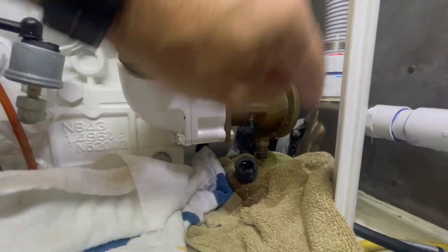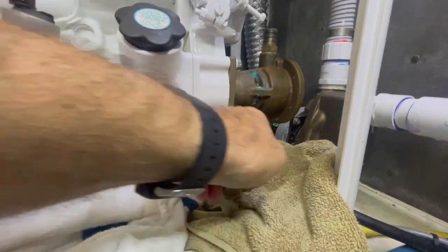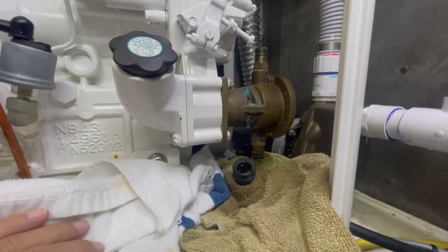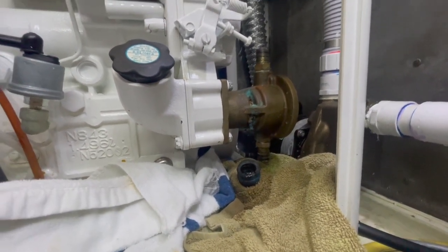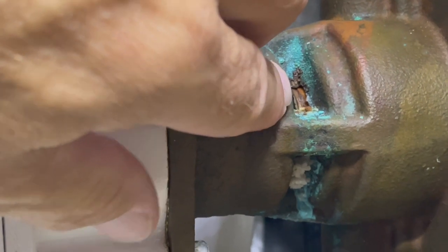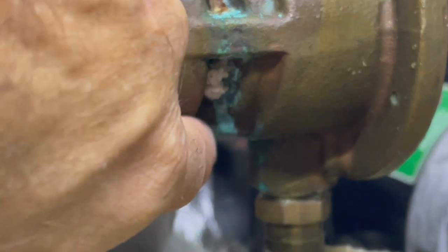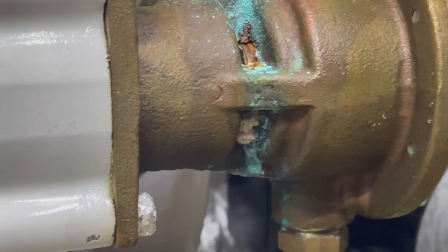The hoses are off — I have this one set aside. It's dripping just a little bit and the raw water pump is dripping a little bit, but it's all being absorbed by the towels. Zooming in, you can see the washer and the seal corroding a little bit, a bunch of built-up salt, and you can see where drips were. So obviously this is something that needs to be replaced.